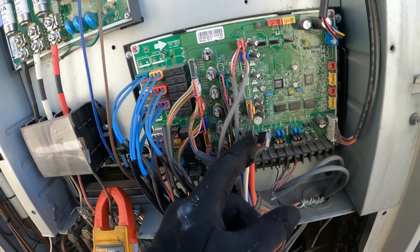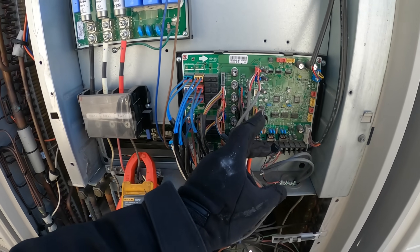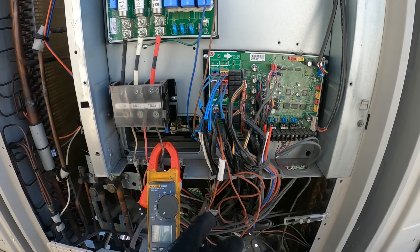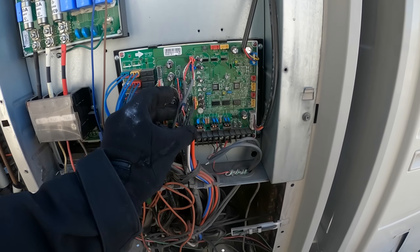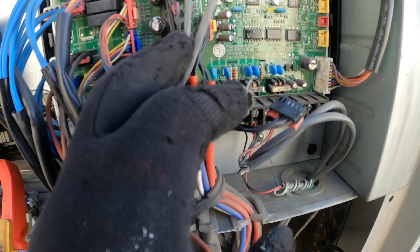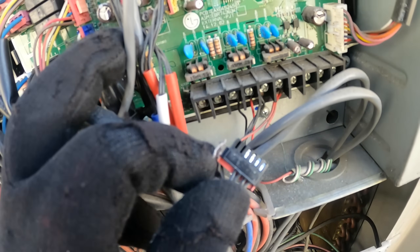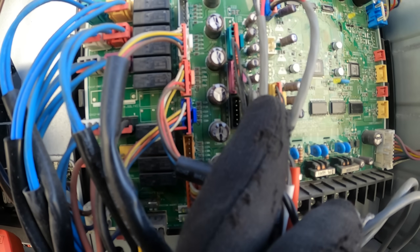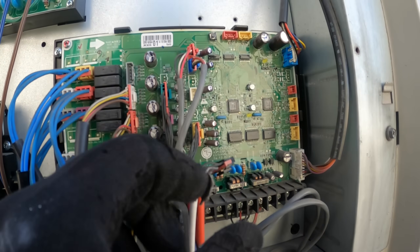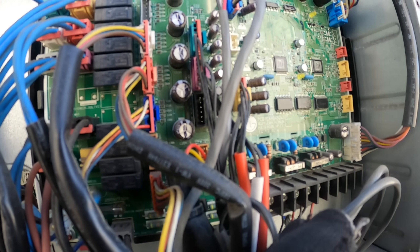So we've got SCN and HXL. We've got these little probes and you would pretty much check resistance — it changes based on temperature. We've got the HXL, and that seems to be the one giving us the issue — the two on the corner here. The other one is SCN — sub-cooler maybe. And then there's discharge.